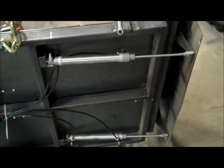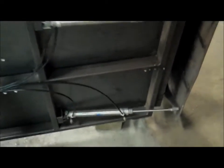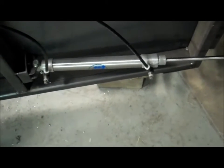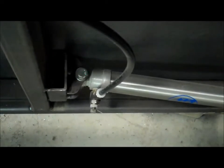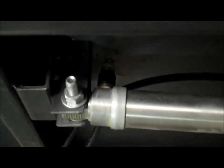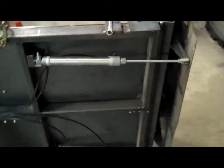those air cylinders. So as I'm working through this under shield design, looking at these air cylinders, I thought, why don't I try to get those flow control valves flipped up on top? Well, there wasn't enough room up on top, and it's like, well, I can make a new bracket. So I did that up top here on this side. This would be the right side. Made some new tabs, flipped the air cylinder, flow control valves are up on top, and it works great.